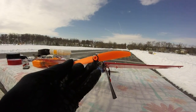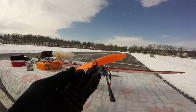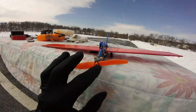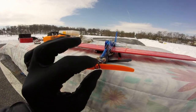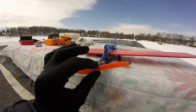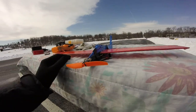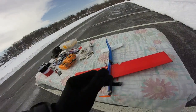The prop I'm using is a 5043 prop — it's an EP prop, so EP5043, a Hobby King prop. They have these little prop bands, so I'd order the smaller ones and they fit on there perfectly. This prop just fits so perfectly and the motor just snaps in place.